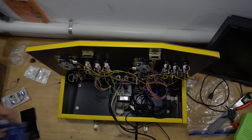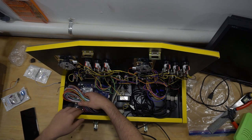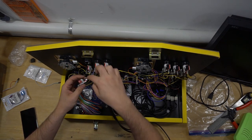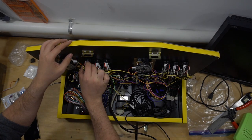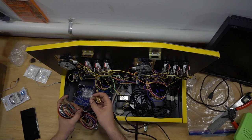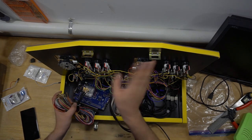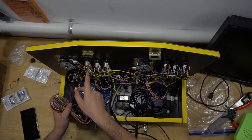As of right now, we finally have the Pandora's Box in our hands and it's going to go in this orientation as-is. Luckily with the JAMA board you can literally fold up the wires with no issues. The big thing with this is that I'm going to take this micro switch off, pull back the plastic, wrap around button one, then put back the plastic covering and clip it back. What's great is that with arcades, the grounds are daisy chained - we will not need all of them. We just put one main ground wire into one string of the ground. Once ground is connected, all grounds are connected, so I can connect this ground anywhere I want.